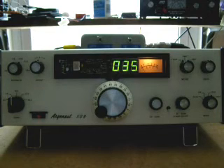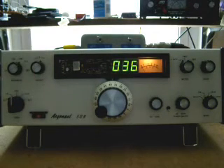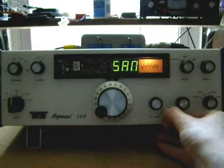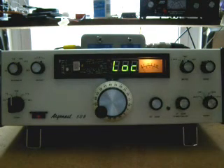There were some interesting design problems to solve in making this circuit. One of them is that if you really want to lock on a frequency exactly, when you click the switch it actually changes the voltage to the oscillator, and it doesn't really lock on the signal you're tuned into. Instead it locks to the nominal voltage — back where the offset was zero. So what I did was a re-sample feature: put the switch down and it samples again. When it goes blank, flip the switch back, and eventually this will correct back to where you actually want to be.